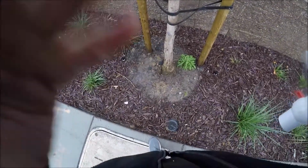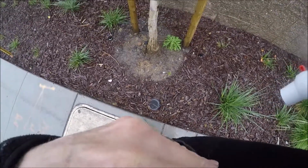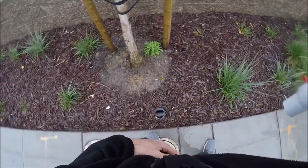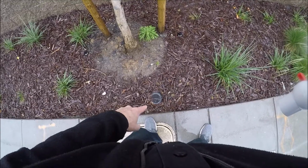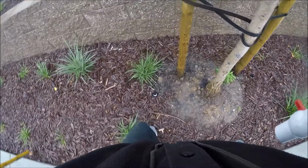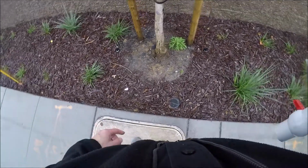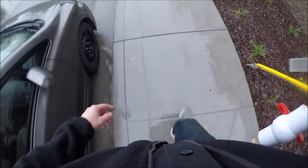So, if you can look out a little bit, you will see they have a combination here. We're making sure that everything is put in per plan. You can see just past my jacket there is a RWS, which is per plan, and also there are some 6-inch pop-ups, and we have our 1401 bubblers. They're doing 2 of those per tree, and it looks like 1 for 2 RWSs. So those are installed per plan.